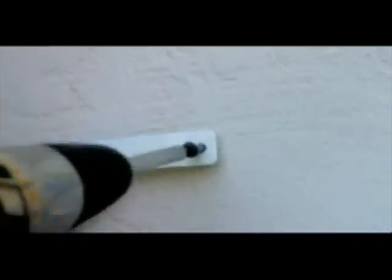After drilling, be sure to put some water resistant caulk into the holes to keep moisture out. Then apply anchors or use masonry screws to attach the bracket to the wall securely.